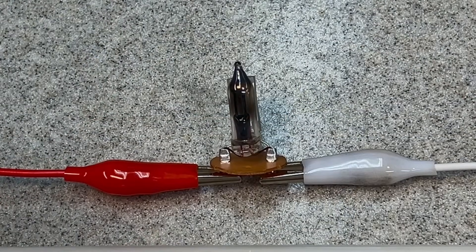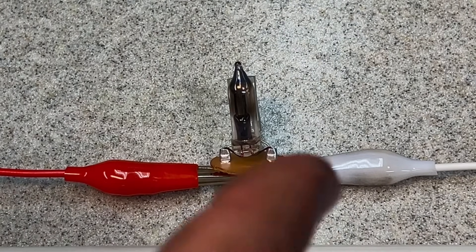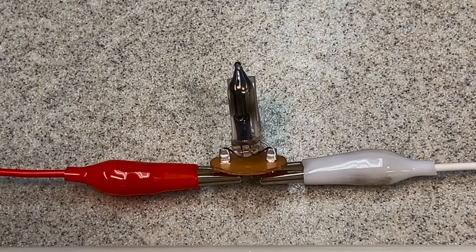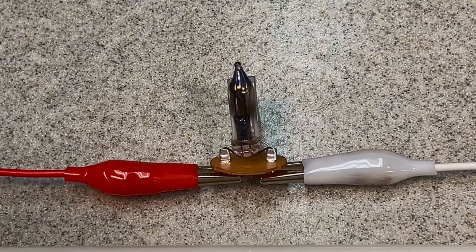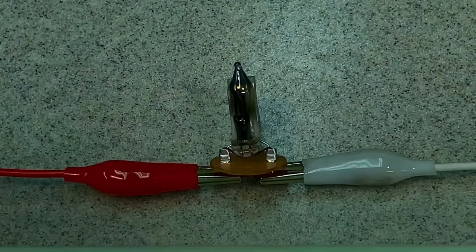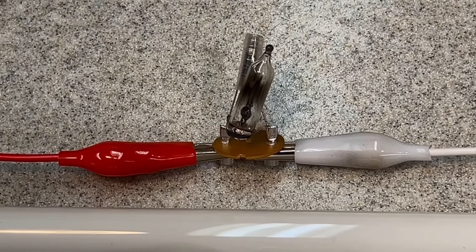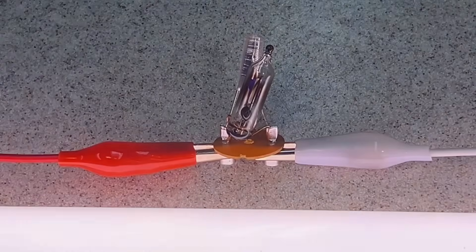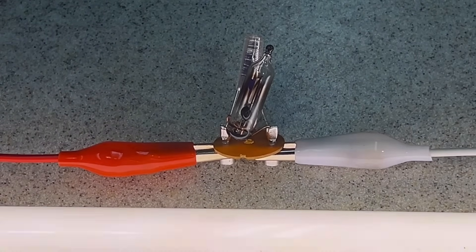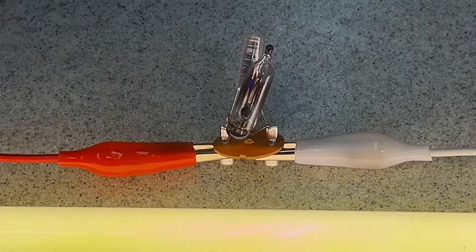This is a secondary starter, but this one was on its way out — that's why it was changed out. Sometimes the capacitors go and not the actual starter — they start to short out. Let me show you what happens when a bad starter is plugged in: you can see it starts the lamp, but then it doesn't have enough to keep it going, it's drawing too much, going back and forth. That's how you can tell when you have a bad starter. Now I'll replace it with the good starter — plugging it in — and you can see we don't have that same issue. That's why starters are inexpensive; you're supposed to change it whenever you change the bulb.